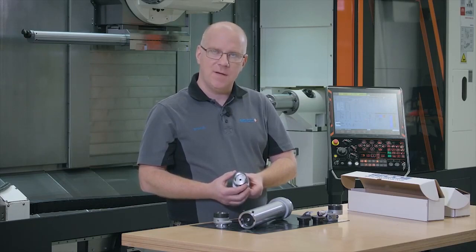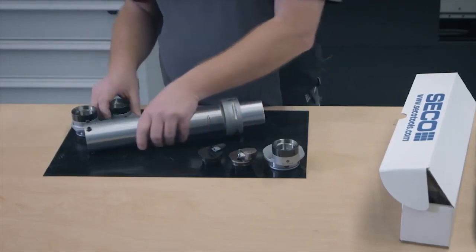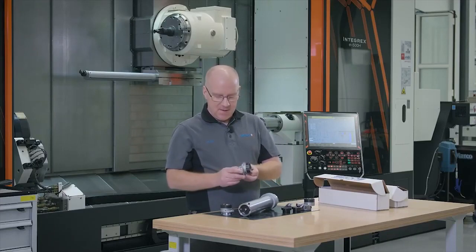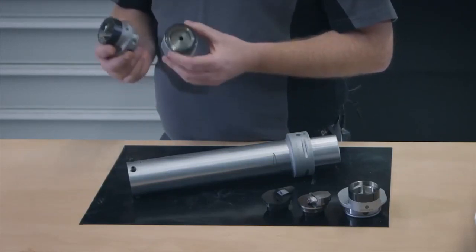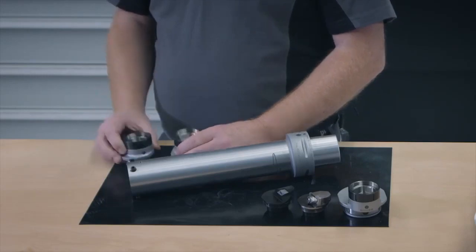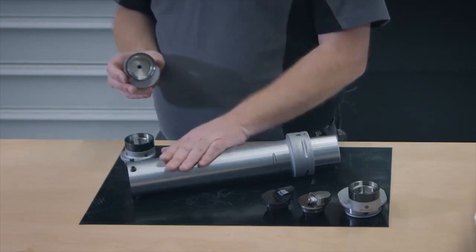It has a locking ring, giving you really fast and easy changing of the tool. For the new ones, we have the BA connection, which has been used for Steady Line custom tooling over a period. The feature of this connection is that it gives us the opportunity to rotate 180 degrees. The BA connection comes in two different versions with two different offsets: one to enter as small a starting diameter as possible, and the other with the bigger offset to create more clearance between the tooltip and the body of the Steady Line bar.